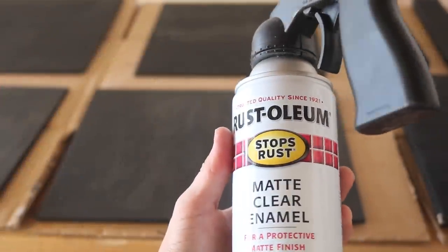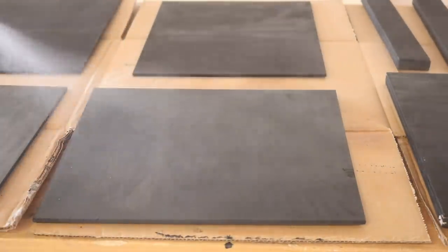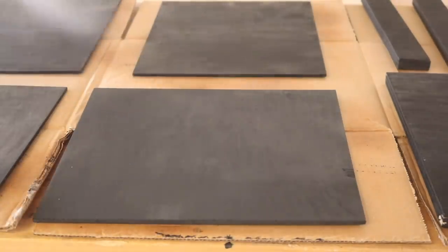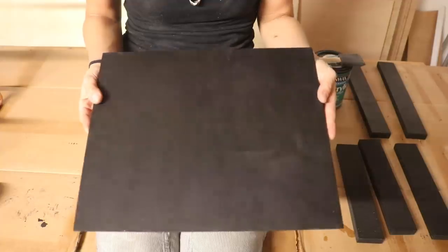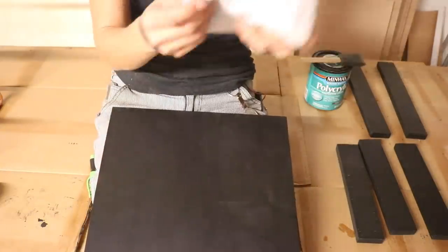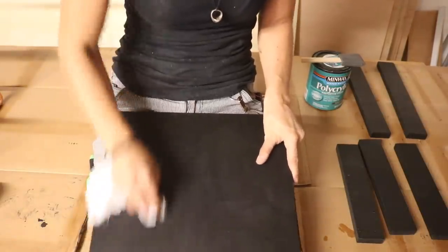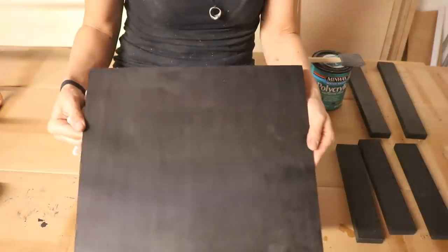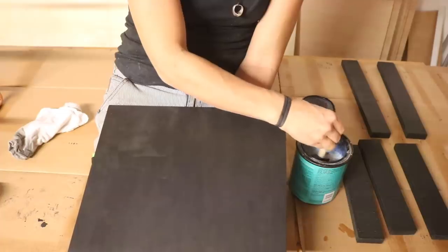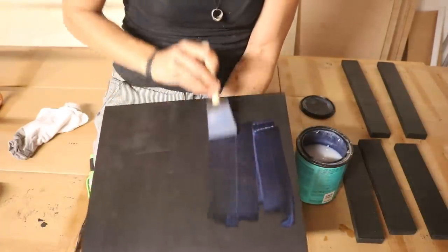I finished the plywood in three steps. First, I sprayed it with a clear matte enamel. Because the ink I used is water-based, it raised the grain of the wood and leaves me with a texture that I do not like. But after spraying it with the enamel, I used a cotton rag to burnish the wood and it made it really smooth — you cannot tell in this video. To really seal in the color and protect the wood and the things that I would put on the shelf, my step three was putting on a coat of polycrylic.